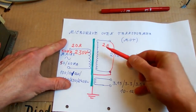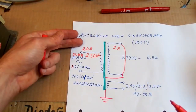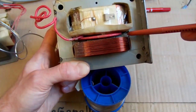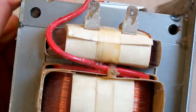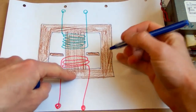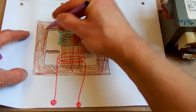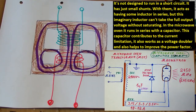These transformers are not really current limited. When shorted, the secondary current is about 2 amps and the primary current is about 20 amps — which is too much and it would very soon overheat. Microwave oven transformers do have some magnetic shunts, but they are not sufficient. The problem is that the shunt cross section is much smaller than the cross section of the core — they can't take the full magnetic flux from the primary. Some portion of the flux can divert through the shunt, but not all, so it doesn't limit the current enough.